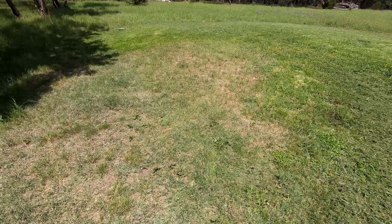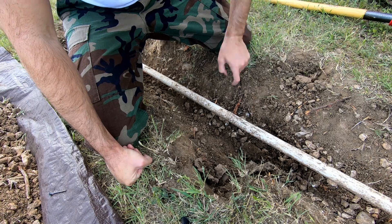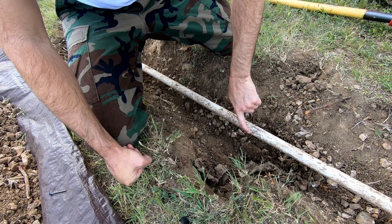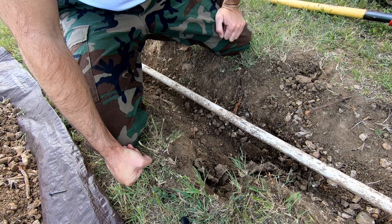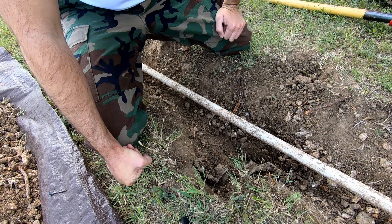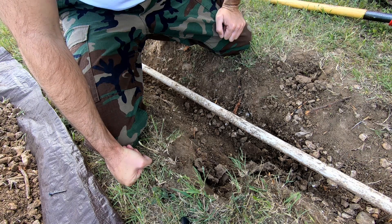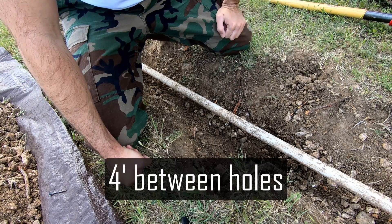So I'm going to dig it up and see what's going on. I dug up about a six foot portion of this dry area and I found one of the holes that's clogged. There is a bunch of tree roots in here as I suspected there would be from the trees nearby. I have the plans for the septic system so I know how far the holes are spaced out, and I'm going to measure from this hole to find the other ones to make this go a little quicker.